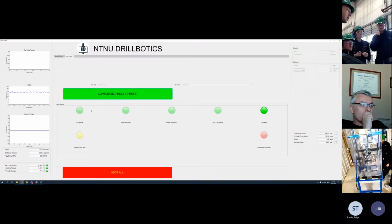What we do is that we drill out the rock. So we calculate where we have to start on the rock and where we should go out, in order to know that our system is actually following the well path that we're seeing, because here we cannot see anything. Other teams try to do survey tools like a gyro or a caliper, but at this size it's challenging to do stuff like that.